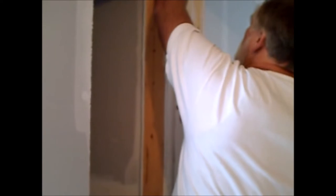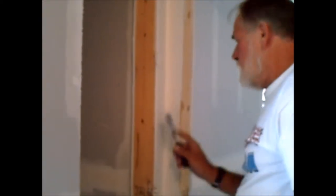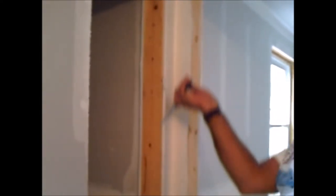Well, once you've got that folded, you'll want to put that in there and use your finger right in the very corner to set your tape, to give it an initial stick into the corner. That way it won't be moving around on you. And generally when you wipe, you want to go about in the middle of the piece of tape. You want to again use a nice firm pressure with your 5-inch knife in that particular corner. Or any that we might do, we're really only moving one side of the knife. So we get that wiped down.